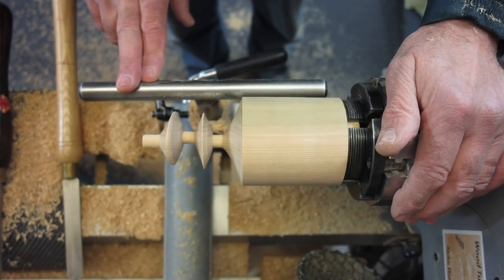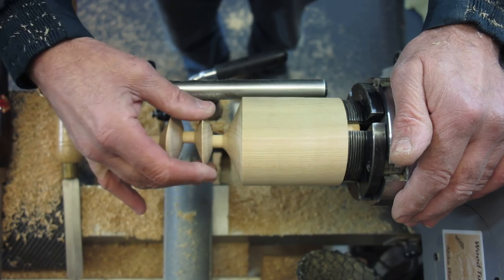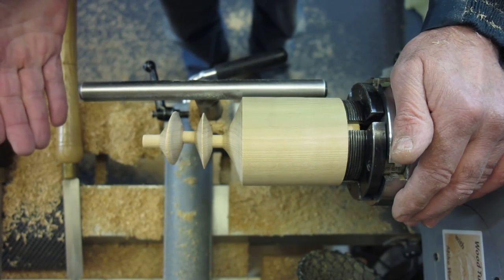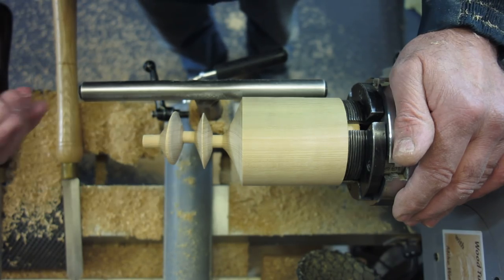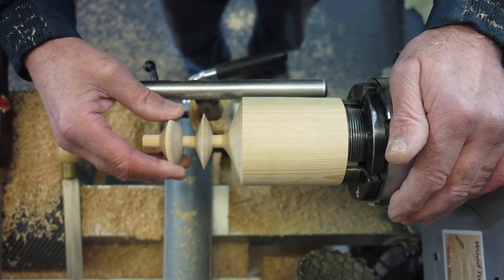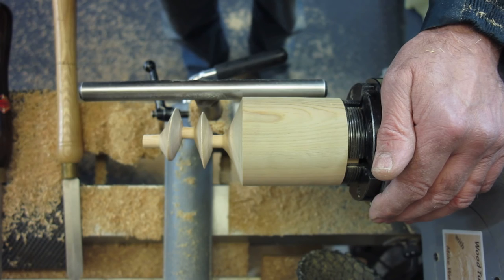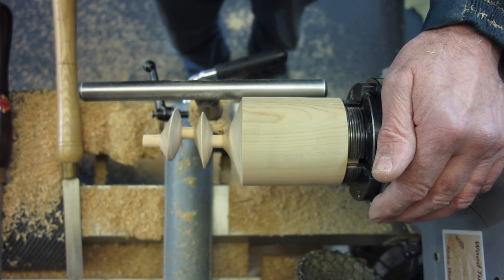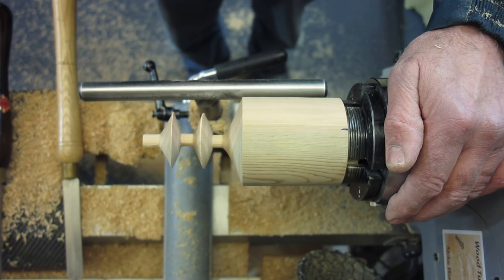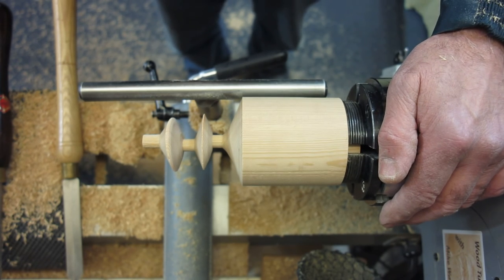So really that wraps up this first video. All I'm trying to do is show you the very basic method of off-center turning — you can see the results that you get with the tool presentation and how to clean things up. It's not perfect but as I say it's a practice session to get the feel of it. In the next video we'll go into more detail of how to alter the shape of the knuckle and not make them look so blocky, and indeed the designs that I take into account when doing an eccentric goblet. I hope it's been of some use and interest — hope you go away and start practicing, and it'll give you something to start from. Well, thank you very much indeed for watching, don't forget to subscribe and I'll see you very soon, cheers now.